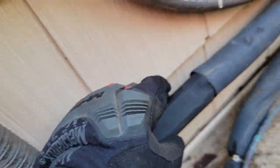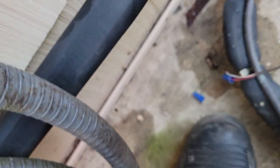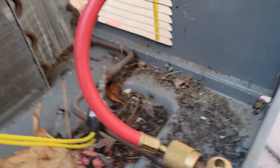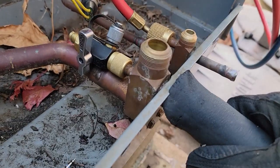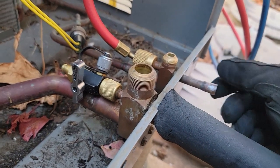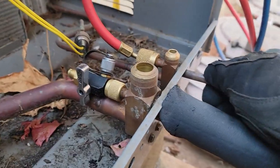I did my first two or three brazes. This one is really close to the house and I didn't want to burn the house, but this is the coupling that I brazed in. I tried using the captain hook tip and it worked, but it was a little more difficult for me, so I switched to the regular tip. There was a very big gap here so I had to fill it in more. I am flowing nitrogen but I just switched it over to the liquid side because I'm going to do a filter dryer and 3/8 line. I have my Schrader pins pulled as well so I don't burn those up, and it'll let the nitrogen out quicker when I'm done pressure testing.